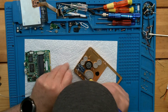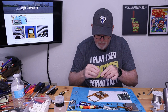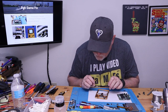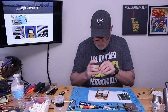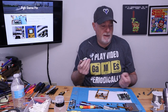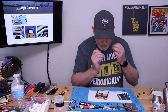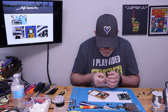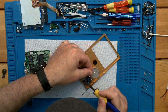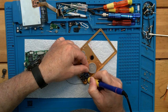I'm just going to tin up these pads. It'll be easier to, okay. And I got some 30 gauge wire put aside. 30 doesn't hold much power, but we don't need to hold much power on this. Anytime I've run an SP on my power supply, I'll set it to an amp output, but most of the time you're talking 2/10, so 200 milliamp. 30 to 25, 26 would be fine. All right, so they're showing this first one being our positive wire. So try to get it where I can show it. Not get my head in the shot. Let's see.